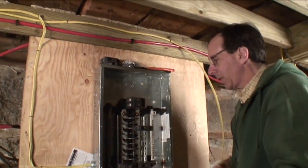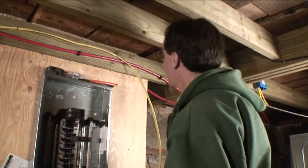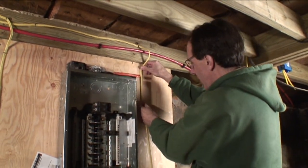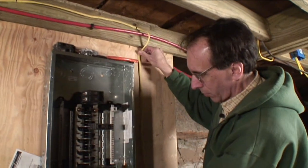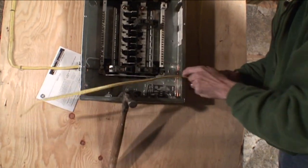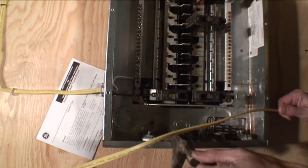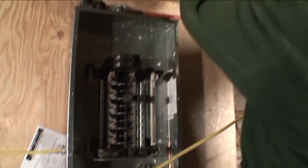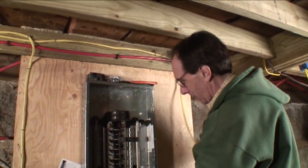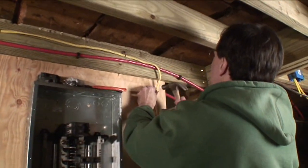When you get back to this panel, if you don't have enough wire, life as we know it is not good. We've got a heat pipe right here we're going over, so we're going to pull it a little bit closer. We need to come in down here, turn a right angle, come in, get to the breaker, get to this bus bar, and get one around to that bus bar as well. I'll rough it, and if I come up a little short I can always pull it out and redo it.